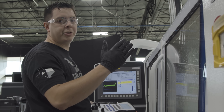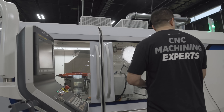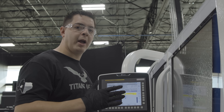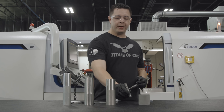We're traverse grinding at 30 inches a minute — that wheel is coming down shooting over 30 inches a minute, coming down again, all the way down. Something to keep in mind is that this is a roughing wheel, and we're still getting pretty good finishes. I wanted to show grinding carbide because carbide gets used a lot in the plating process, and grinders are typically used to grind that down and produce a smooth finish. That's 40 thousandths off of carbide.